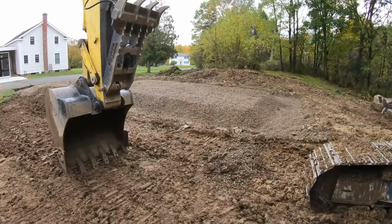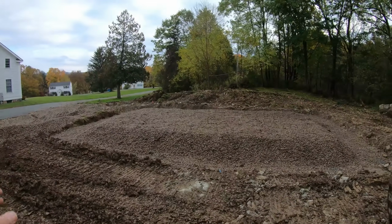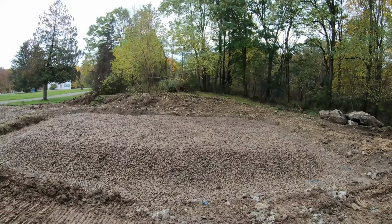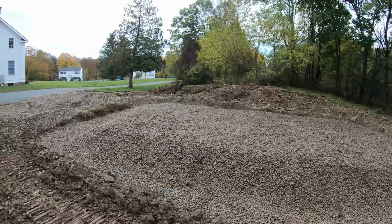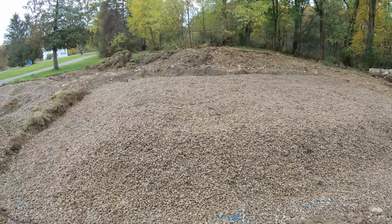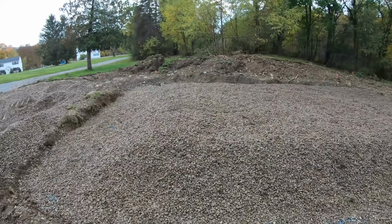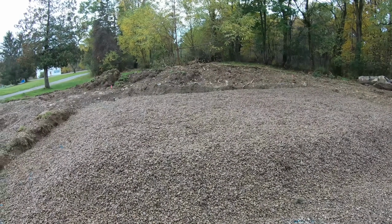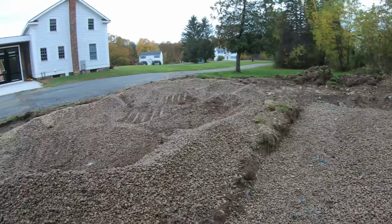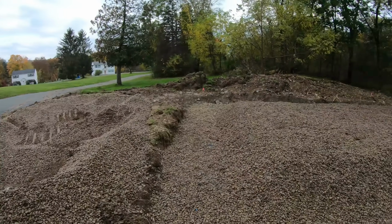All right. Like I said, I just shot it real quick. I'm about 1.5 inches, 2 inches low, which I knew that's what it would be because I put it in at 6, and it called for 8 after we adjusted the grade. It's just roughed in. The 45s aren't where they've got to be either. We'll get these boards all in around the outside perimeter, then adjust the center. After everybody walks on it, stomps on it, then we'll give it a final touch. But yeah, this is gonna be nice. We're gonna quickly box this out so we have a parking area.